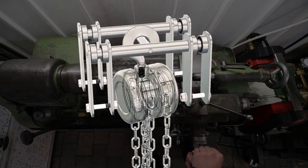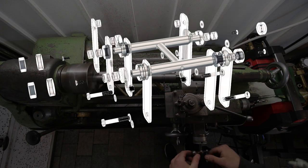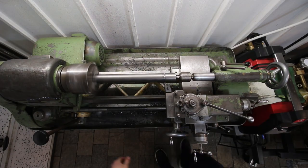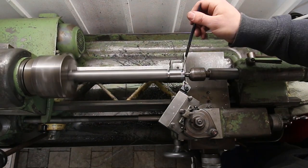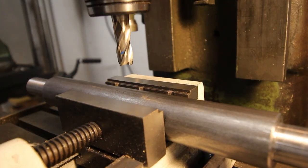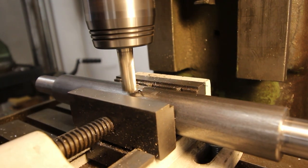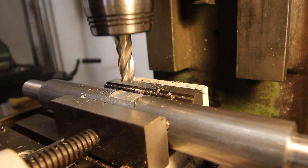The trolley is riding with two axes on the two rails of the gantry. These are connected with one bar for the hook of the chain hoist to hang to. I'm starting with machining these two axes — I milled this flat spot to the bar so it's a little easier to drill through and to have a better registration surface for the parts to meet later on.